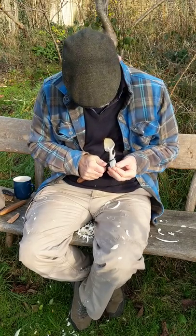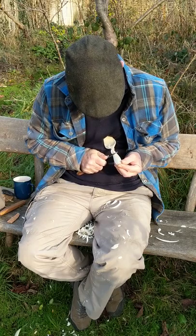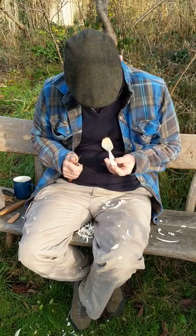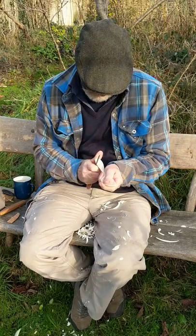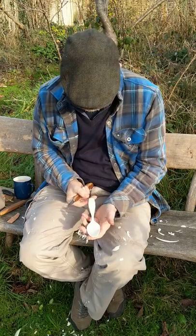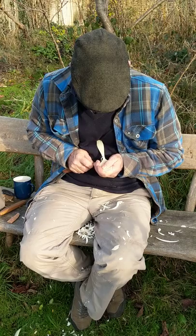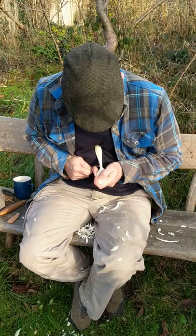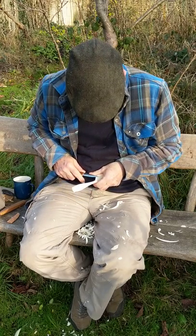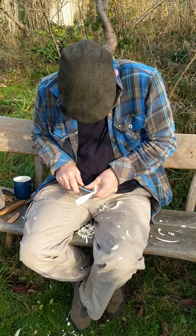All the time when I'm carving, what I'm doing is feeling — pushing the knife flat on the surface I'm carving and sliding it along again until the edge engages. That way I can continue a surface. Sometimes you get it all in one go, which is best, but if the knife pops out then you can just put a little bit of shape on there. When it pops out, go back and come sliding along that surface you've already made.